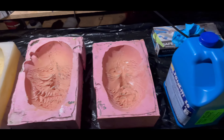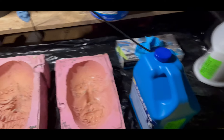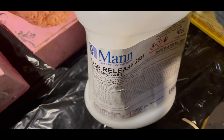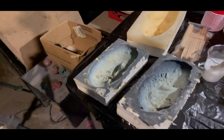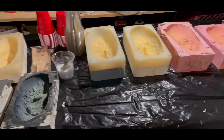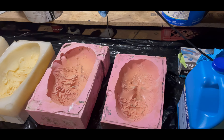We just put the mold release in. Mold release — let me show that to you guys. It is Mann mold release 2831. It is a brushable release. They do come in spray, but the spray I have found does not do a good enough job, and on top of it, it likes to blow back up in your face. So unless you're wearing top gear and stuff, you'll be sucking on wax in aerosol form, and that's not fun.